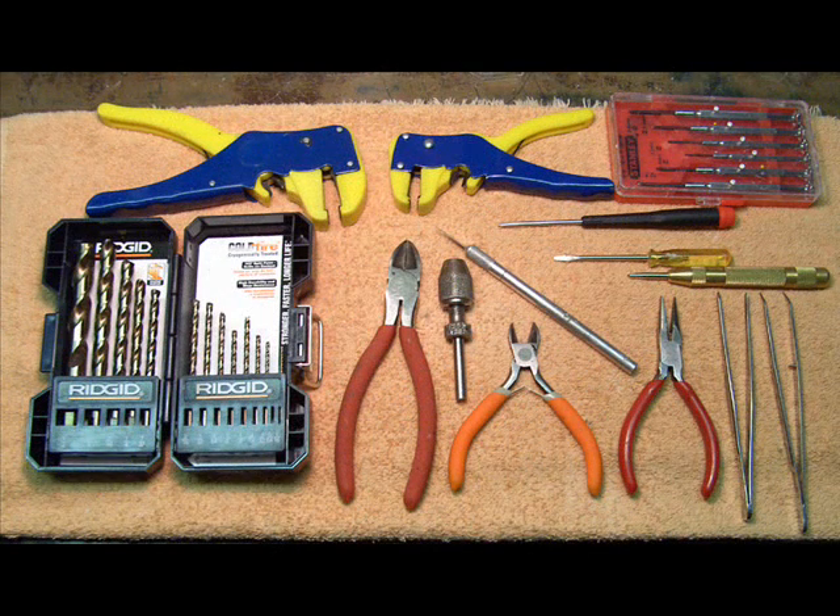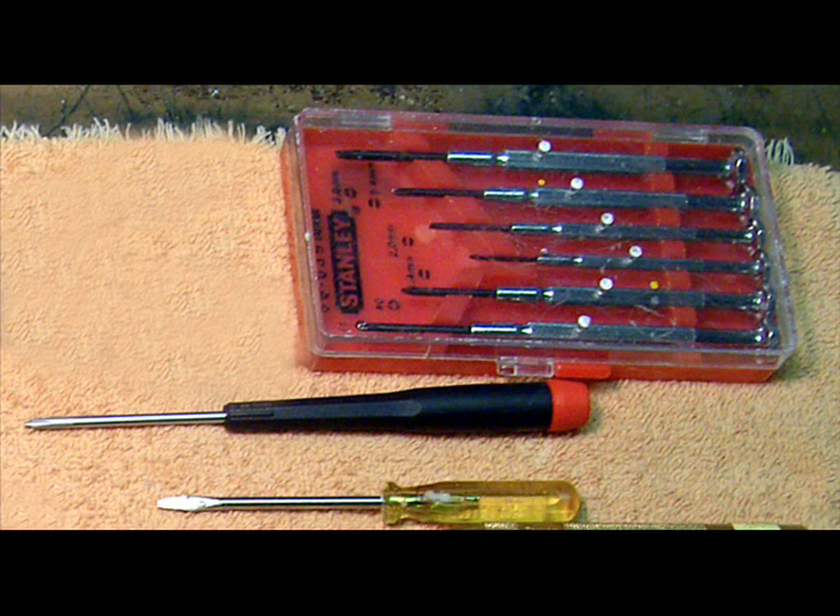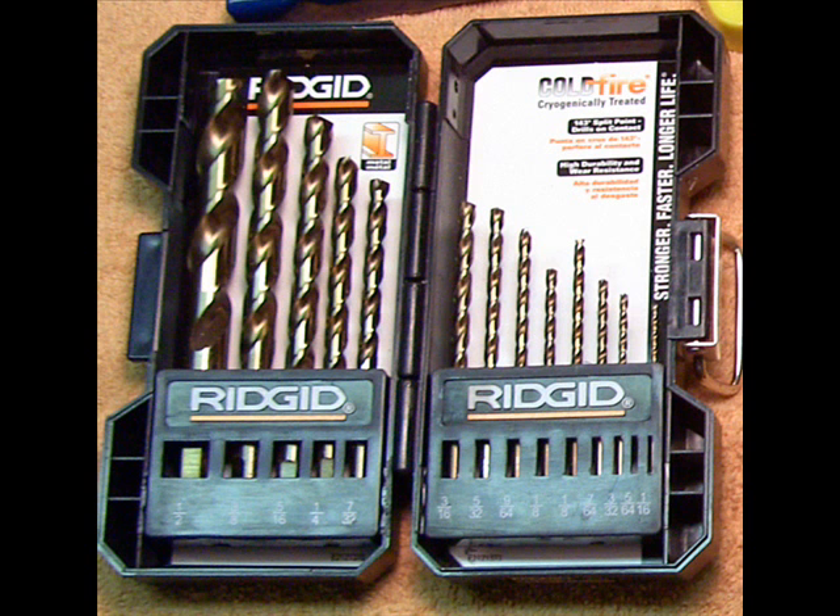Here's a look at the tools I use. There's no hard and fast rules — you may find others that work better for you. The tools shown here include wire strippers; I use a couple I bought at an aviation event but you can use any other type. A set of jeweler screwdrivers in both flat and Phillips blades — notice I have screwdrivers of each type with a larger handle for times when more turning force is needed. Cobalt drill bits: while die cast metal is usually a mix of zinc and aluminum, it's pretty dense after having been forced into the mold under extreme pressure, so regular drill bits dull quickly. In reality you don't need to spring for a full set; I seldom use anything bigger than those on the right side.